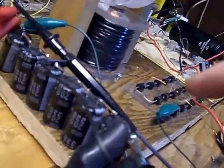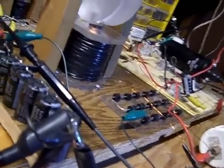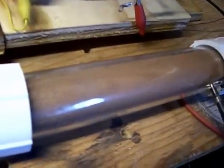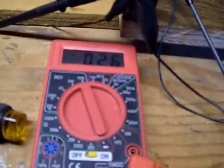What I'm going to do is plug the power back in. A lot of the noise and the spark and everything is muffled inside that tube, but it's jumping. Each of these caps are 200 volts, 330 microfarads — so 330 divided by about 6 is about 50 microfarads at 1,200 volts. Now this capacitor bank is sitting at 4 volts right now, 5 volts. And what I'm going to do is spin this — I'll just spin it and get it going on — I don't know if you can hear the clicking. And then we can look at this and it's charged up to 20 volts. And if I stop it, you can see it's at 26 volts.